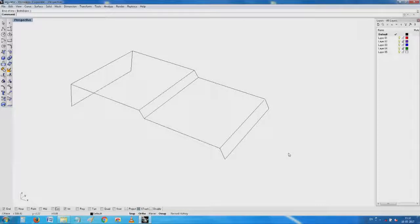Now comes the other point, saying can I now use it for practically creating sheet metal parts. So, you will notice here we have the side profiles. And if you remember the sheet metal exercise which we were talking about earlier, a lot depends on thickness, what thickness overlaps what, and whenever you bend there is a little bit of empirical as well as a theoretical thing about what happens to the material in the corner.